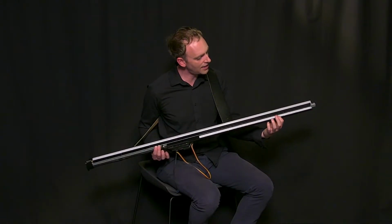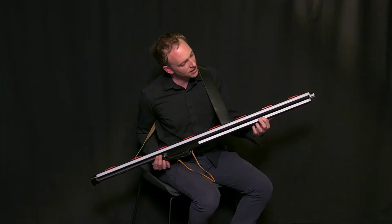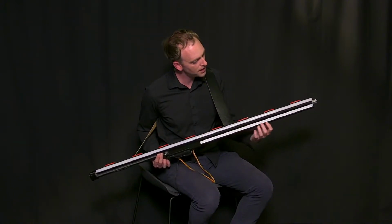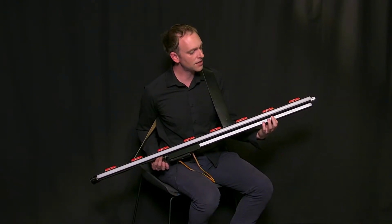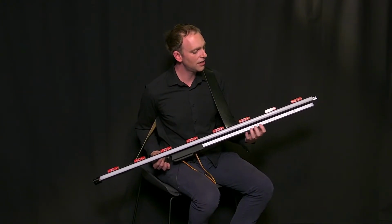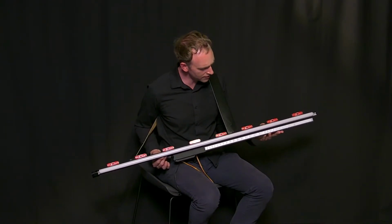And then I added a Teflon strip that I laser cut to also include fret positions here. And so I've exposed, using the laser cutter, little areas of that silicone pad where guitar frets would normally be spaced out. And so the Teflon allows your fingers to slip and glide effortlessly from one fret to the other. And then your fingers can feel when they stick to that silicone pad. And so without even looking, your fingers can nimbly move around on that fretboard, feeling where they're at without having to look down at it.